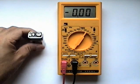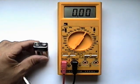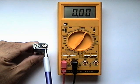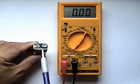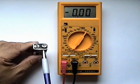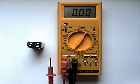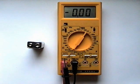The 9-volt battery has two terminals, a positive terminal and a negative terminal. The voltage between these two terminals is 9 volts. To measure the voltage of the battery, we will use our test leads. The black lead is the reference lead.